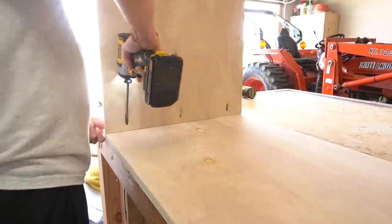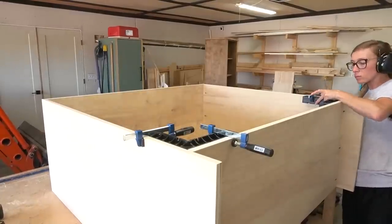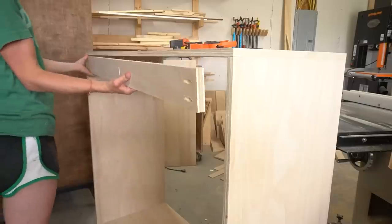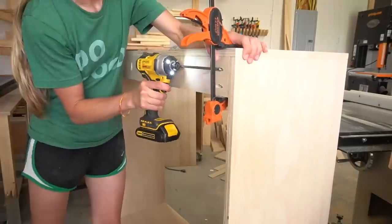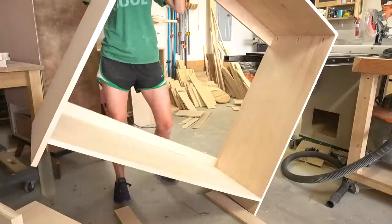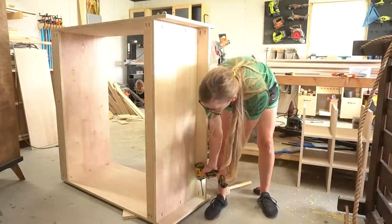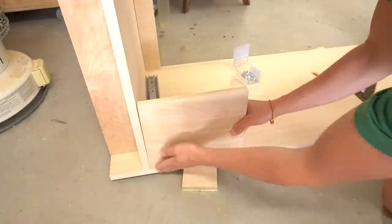Either way works fine, but flush is a little cleaner, faster, and stronger. I used clamps to hold the corners square while the glue dried, then moved it to the floor to add bracing. This cabinet needs to be secured to the wall, so I added scrap pieces across the back at the top and bottom to screw through into the wall studs. I then flipped the dresser on its side and installed a toe kick piece about three inches in from the front edge of the cabinet. All the bracing and toe kick pieces were made from three-quarter inch birch plywood.